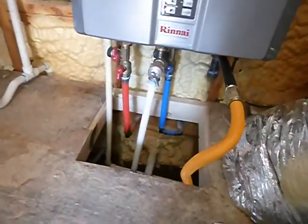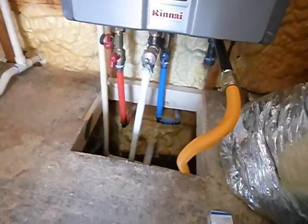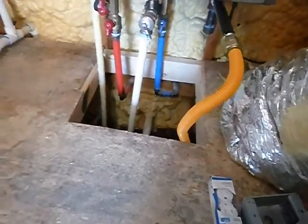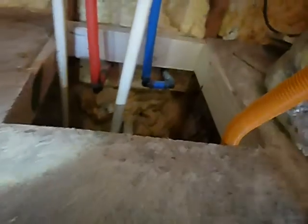Because it's a high-efficiency gas heater, the condensate drain should have a neutralizing filter on it — that's what I'm thinking. I reserve the right to be wrong and I reserve the right to change my mind, but this is a good idea right here.